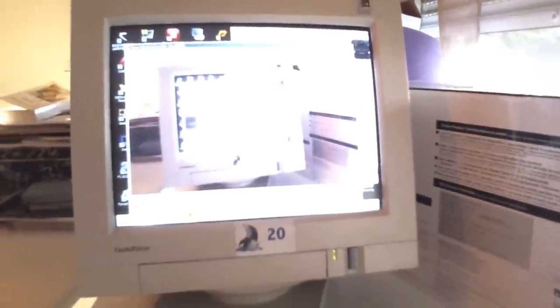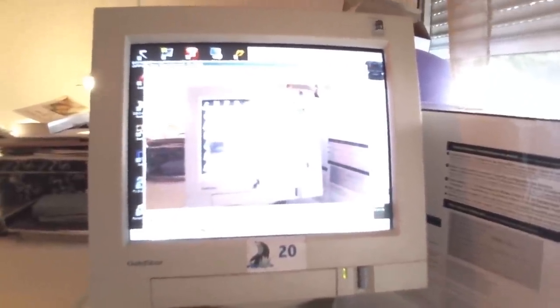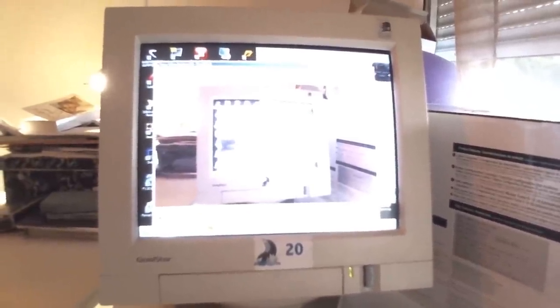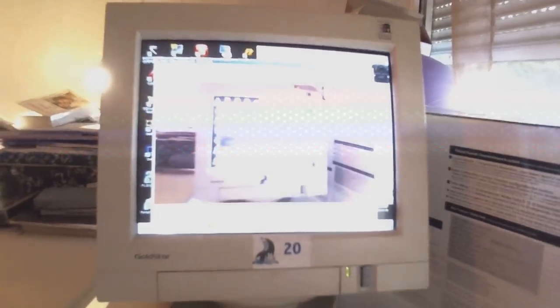So now let's go closer to the CRT PC monitor and have a look at the examples I showed in the first video for the CRT TV, and let's see what's happening on this monitor. Here we are in front of this first example. You remember from my previous video, this image is made of four lines, one red, one green, one blue, one white, and each line is made of only one pixel. And in the center, the intensity is increased compared to the edges.